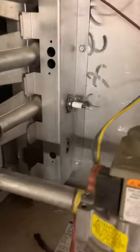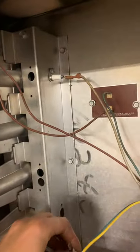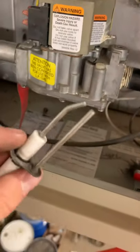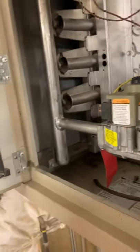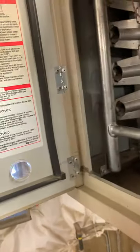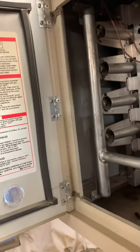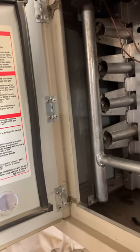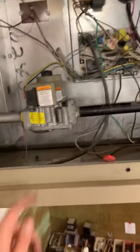After that you'll want to pull out your igniter and your flame sensor, check them out and clean them up — I've already removed these and started cleaning. If you have a lot of time and it's allowed by the customer, I like to remove the venturi tubes — I'll explain what those are another day. As they start to get buildup, the flame has difficulties jumping across, so you pull those out and clean them.